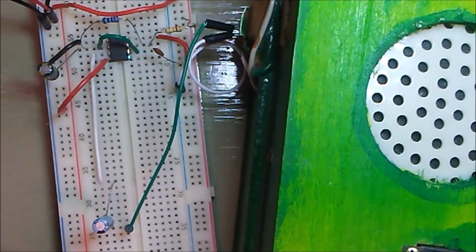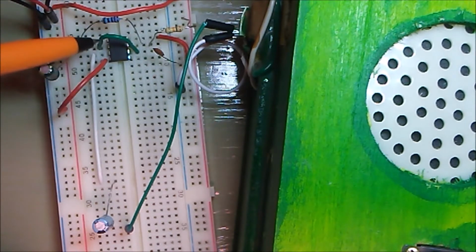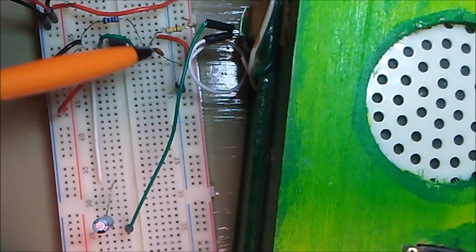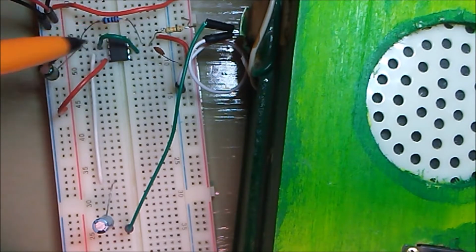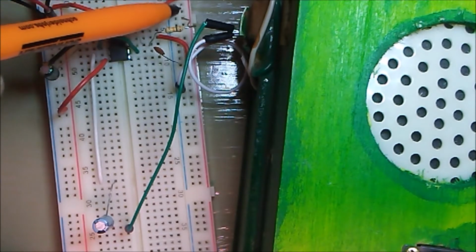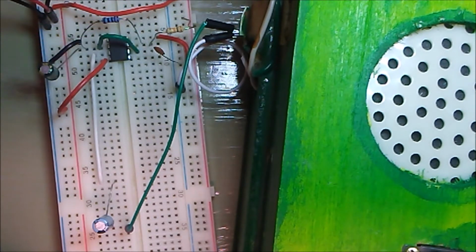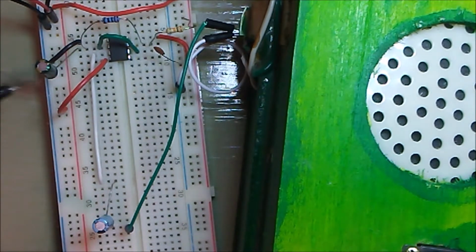I just mentioned that because this circuit is similar and it's used to generate a tone. There are a few differences. So here's pin 2 and 6 being jumpered, but also from pin 2 is a 220 ohm resistor going over to pin 7. And also on pin 7, there is a positive supply going through a 10 kilo ohm resistor into pin 7 as well. And there's also a capacitor here, 1 microfarad from the negative side into pin 2.